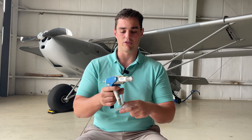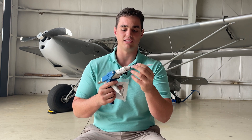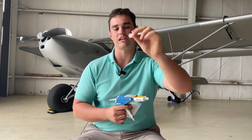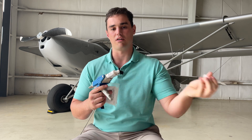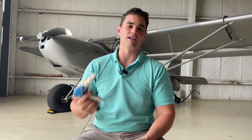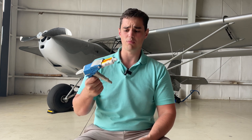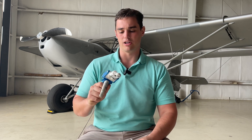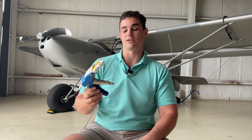When I bought the dispenser it really changed things. You can very precisely put hysol exactly where you want it, so you're not wasting. It instantaneously mixes the 50/50 ratio down the tube. When you're done, there's no excess — you just take the head off, throw it away, and put another tube on later. There's no waste, no mixing, no mess, and you get exactly what you want where you want it. Kit Fox uses a pneumatic industrial gun at their factory, but this thing was just 25 bucks on Grainger.